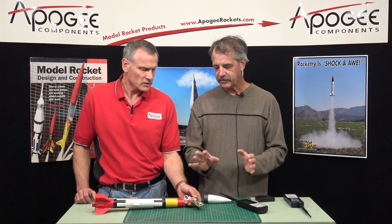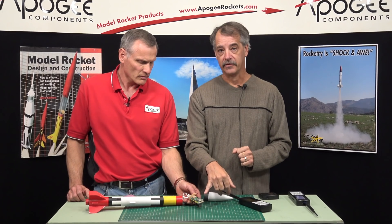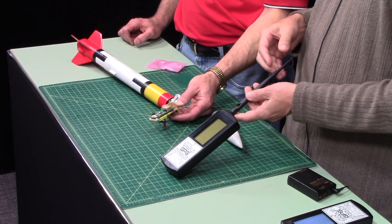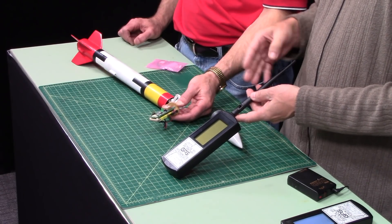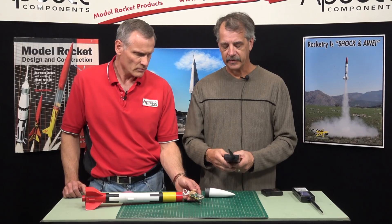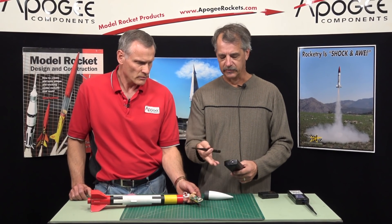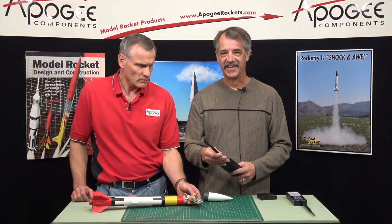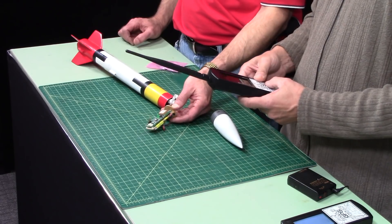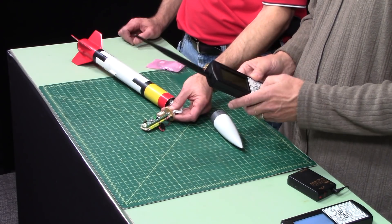The range of any radio system is set not only by the power you're transmitting with and your transmitting antenna, but also the sensitivity of your receiver and your receiving antenna. For this particular setup with the short whip antenna, we can probably get at least a couple miles of range through air. If needed, this antenna can be unscrewed — it's just an SMA connector — and you can screw in Yagi antennas, high-gain base station antennas, or other types. There's a wide variety of antennas available online that you can attach to this unit.